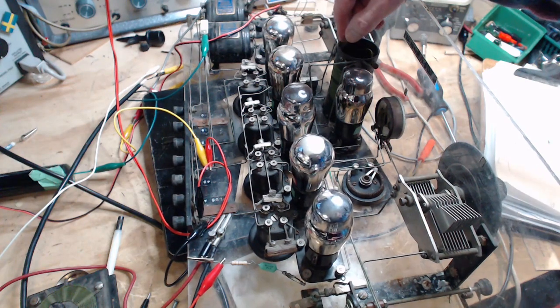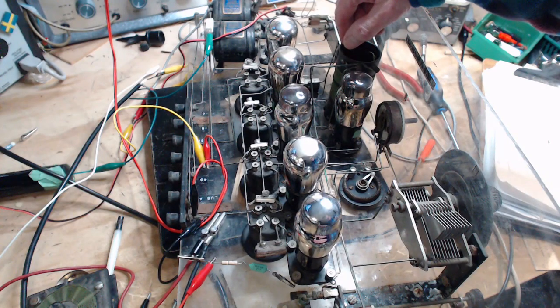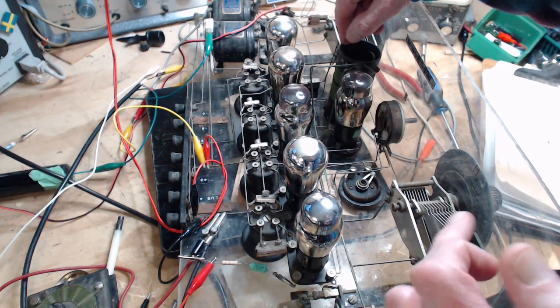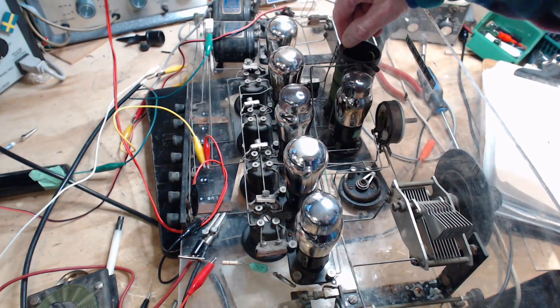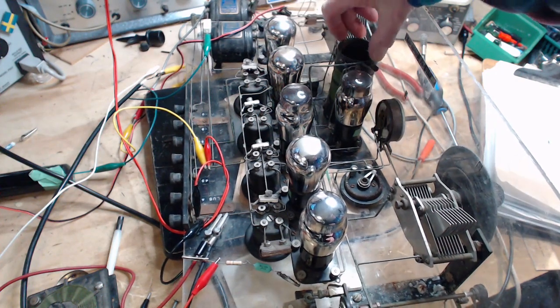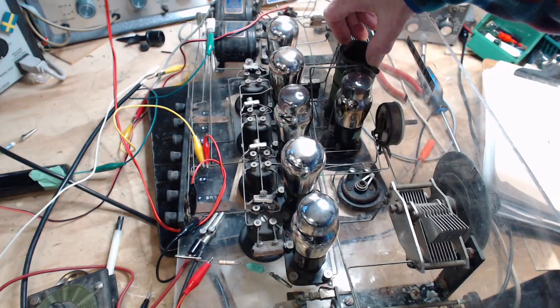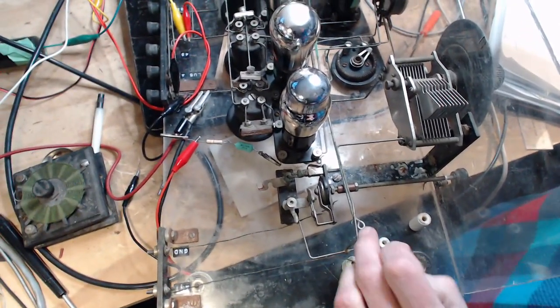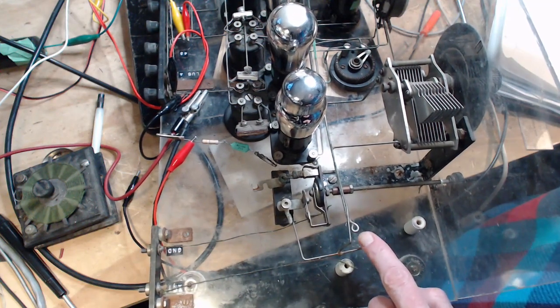And then they have the Steinite coil here, boosting the antenna signal a bit. You have the boosted antenna signal going in with the oscillator signal, heading for the grid of this tube. And then who knows what happens on the way out. The oscillator signal has got to get from here. See, this is really out of control, isn't it? And maybe this was to try to bring it into control. Give it a little bit of this resistor here, maybe to give it a little bit of control from the oscillator.